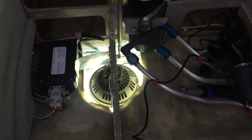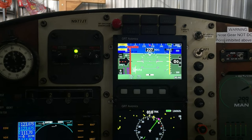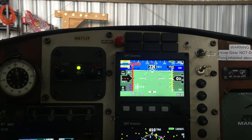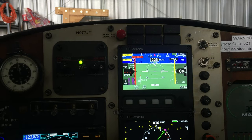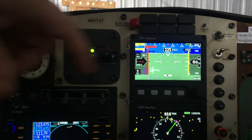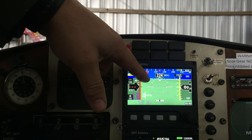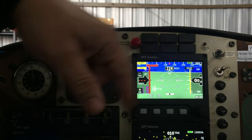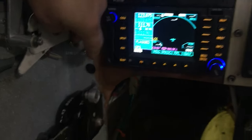When I drop the landing light into the airstream, there is even more left turn indicated. Of course we're not actually moving, but what that creates is on the EFIS I get crazy-looking indicated winds of around 50 knots. I'm pointing straight at the airport — I can see my runway is over to the left and my flight path is over to the left, so I'm still going to it — but it all appears like I've got a 30-knot crosswind where in effect there is nothing. Now let's turn that switch off.